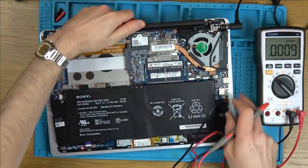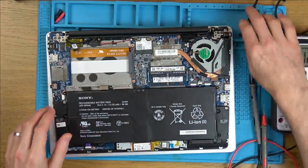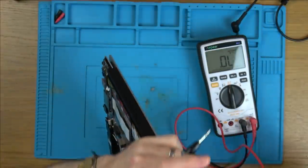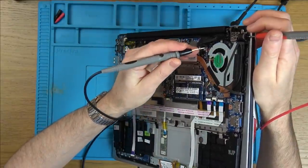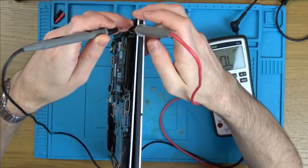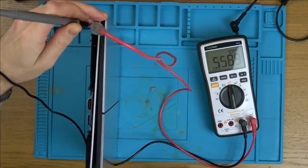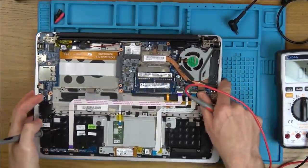Let's see if we've got voltage. Let's unplug this and see if we have a short on the incoming. Let's go to continuity - we've got red and black on this cable here. We've definitely got a connection between those points. Now if I go between here and here, that will show me whether we have a short or not. Yeah, so there's no short there. That's a little bit of a shame because I was hoping to get something with a short that I could actually fix.